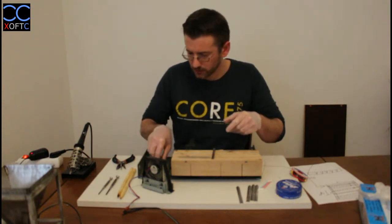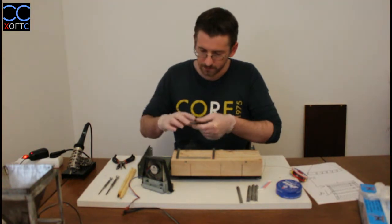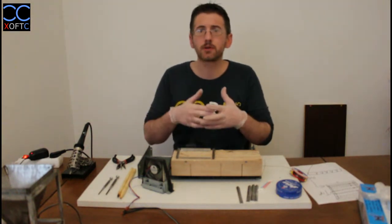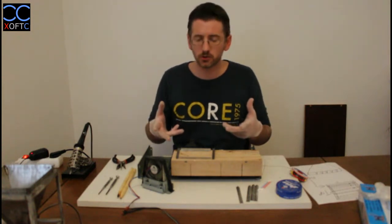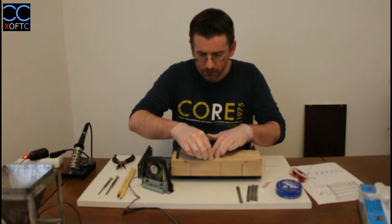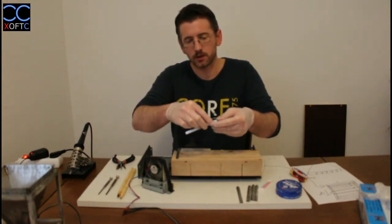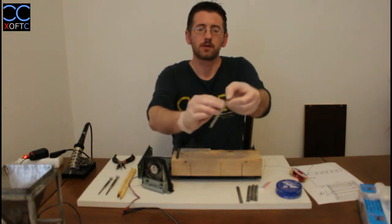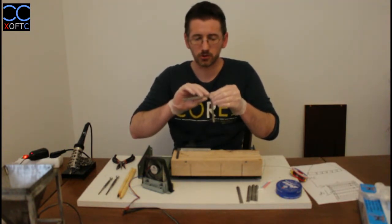So we're first just gonna see which areas we're actually going to tin. There is a lot to explain about joints. You have overlapping joints and you have butt joints where two faces come together. In this case, we're just going to do overlapping joints. I'm going to explain this in a more dedicated video because then it's going to get too long. So just know for now that we're going to do overlapping joints, and that pretty much means that we take one piece and we place it over the other so that the metal overlaps, and where the two metals will meet, I don't know if you can really see that, but you can pretty much know what I'm talking about. There we go.